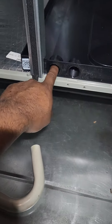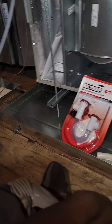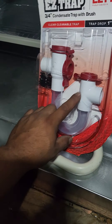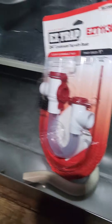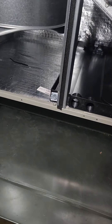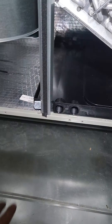A lot of drain problems literally happen right here coming out of the unit. If you can add one of these, you can brush it out yourself — you have three access points: one, two, three. Quick tip: if you don't want to pay somebody and you have a little bit of water under your unit at home, you can clear those drains yourself. Then we put this pan underneath.